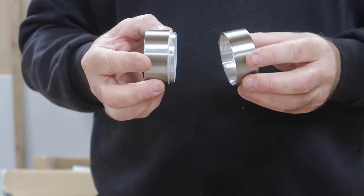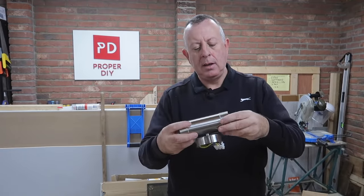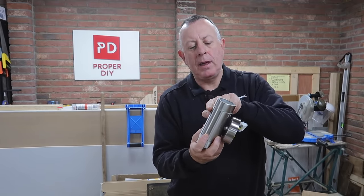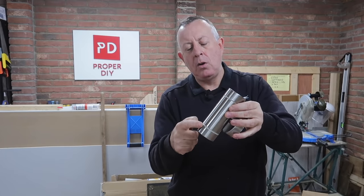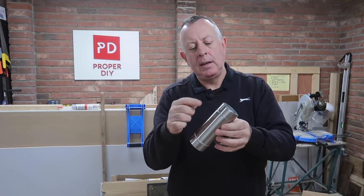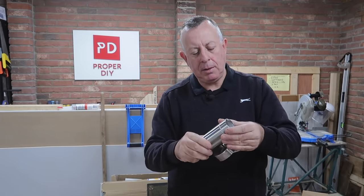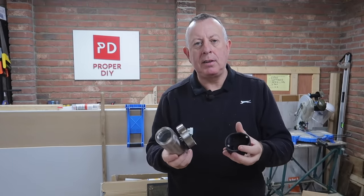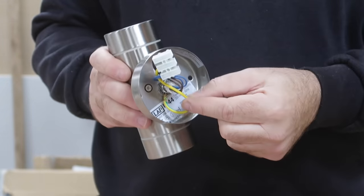Most people don't know that even the lamp part needs to be orientated the right way. The threads that contain the lamps underneath are different — you've got a male thread and a female thread. If orientated correctly, water will tend to flow over the threads; if it's upside down it has more of a tendency to get into the thread and into the fitting. So make sure both items are fitted the right way up.